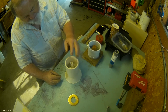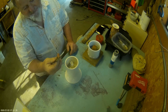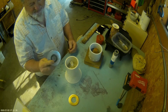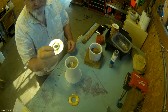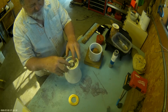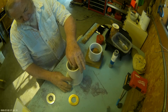and I place the section of PVC on the funnel, and I place a 1.25" USS flat washer, which has a 1.4 inside diameter. And I've made a centering tool out of the USS 1.25" washer, and I think that's a 5/8 flat washer that I just glued inside there, that kind of centers it. And I place it over the tip of the funnel. That centers my pipe on the cone. So once it's centered, I hot glue around the outside edge.